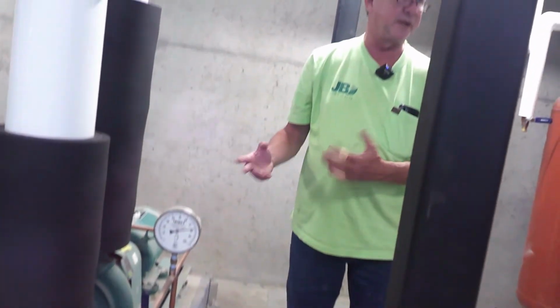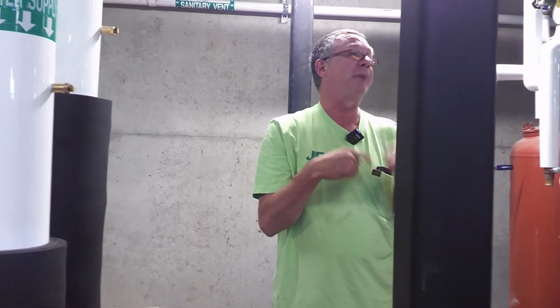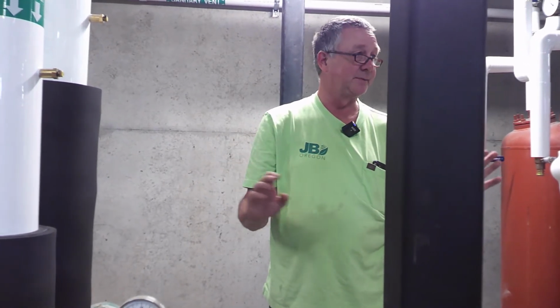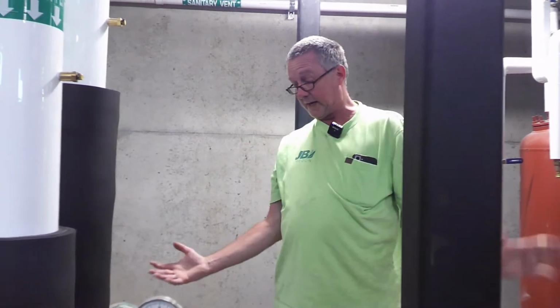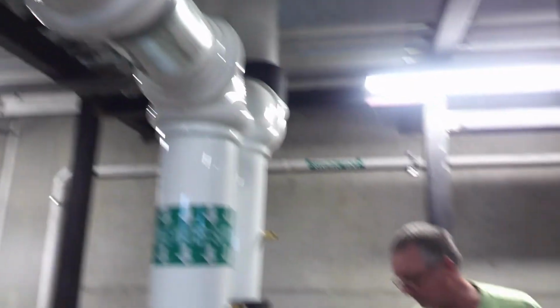You deadhead a pump and it's running, it doesn't know that it doesn't have a return path. So it's just going to keep running and keep running. You're going to heat up, the seal's going to crack. Once they crack, water starts going everywhere. Okay? So if you come in and there's water all over the floor, it's like, uh-oh, isolate it immediately. Well, turn it off first. Duh. Isolate it and then go, yeah, we need to replace that.